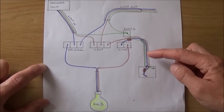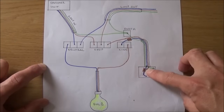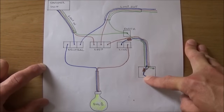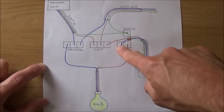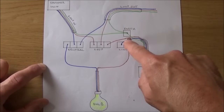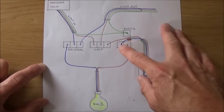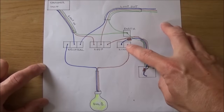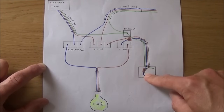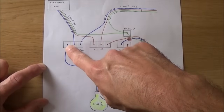The switch is slightly different. On the switch cable we take the brown live wire from the loop and take that down into the top of the switch. We return the power back to the ceiling rose through the blue wire, placing the blue wire into the bottom terminal on the switch and then into the line on the ceiling rose. Now because this is acting as your switch live we need to place a piece of brown tape over the top and bottom of the wire to indicate it is acting as a switch live. Then with our light cable we take the brown live wire from the line and that goes down to the bulb — when the switch is turned on and off this provides the power to the bulb. We take the blue neutral wire and return that back up to the neutral terminal.